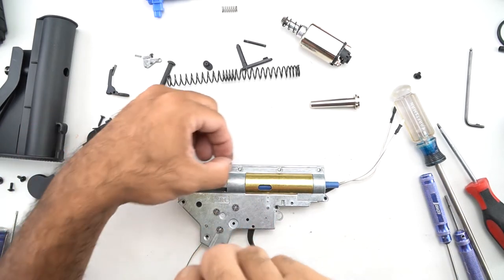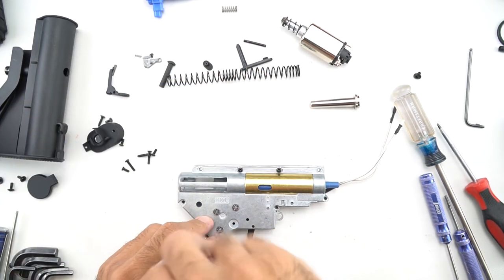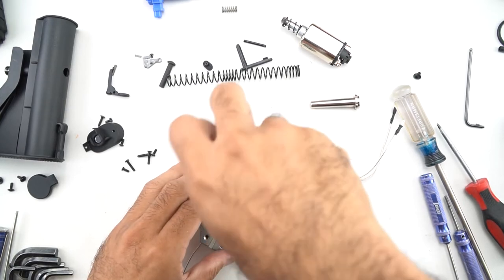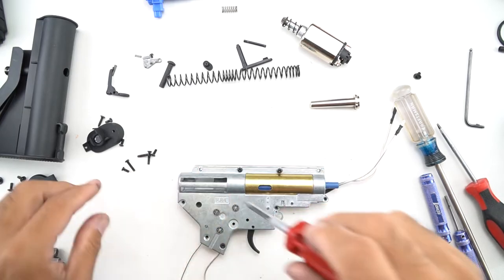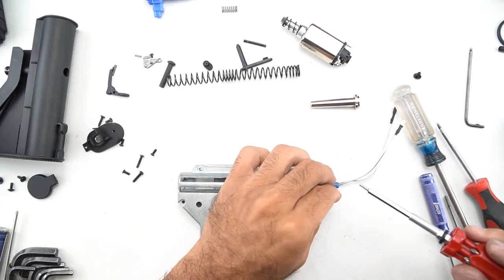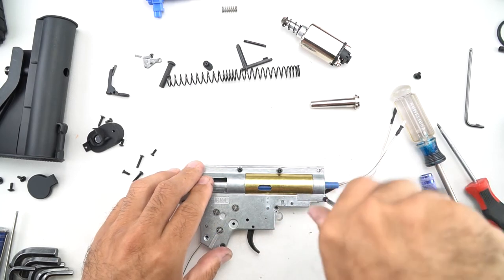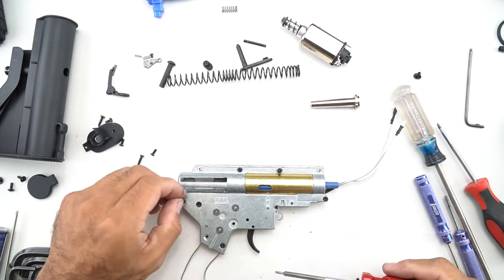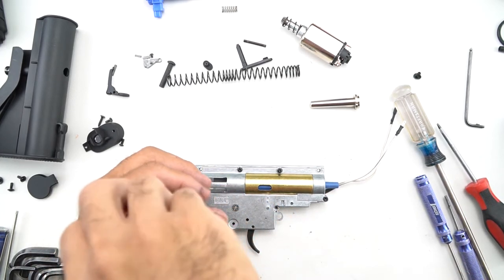I hate lower grade gearboxes or ones made on poor tooling where things just kind of fly out no matter how you put them. My little litmus test is to make sure that the trigger can stay on its own with the spring on — and if it kind of just twists itself out, then it's just kind of put together meh. So we secure all the Allen screws, kind of tighten in a star pattern, and we're good to go.